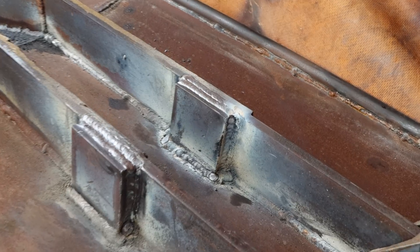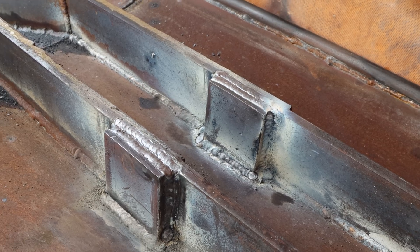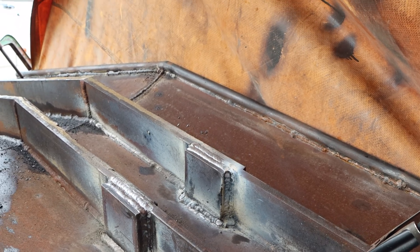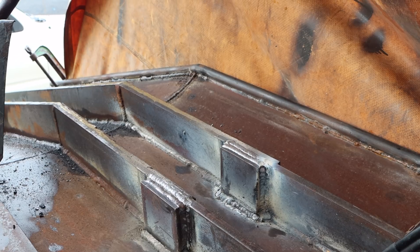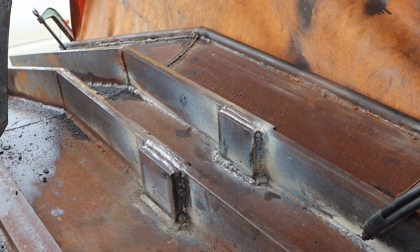Now that we've got these two cheeks welded in and they're parallel, with the pin turning nicely, we need to figure out how we're going to do bracing. I need to do internal bracing that's going to act like a doubler underneath the skin of the wing, and also one on the top and bottom plate. I'm going to get Jess down to decide what she wants in terms of strengthening inside these wings. Now that we've got the heavy-weather welding sorted, I just need to grind the tops of those welds down so they're below the level of the skin — otherwise it'll leave a dimple in the wing. We need to both be pretty happy with the internal structure; we're going to some pretty remote and rough places so we don't want anything to let go.